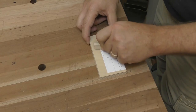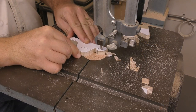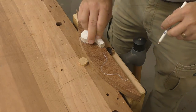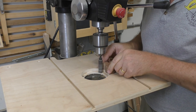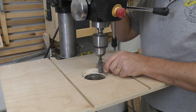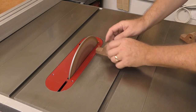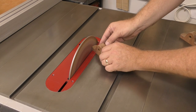The pivot blocks under the arms also need a template, but they're small enough that the drawing can be printed out full scale and pasted onto the plywood. Shapes are traced onto the stock, rough cut out, then sanded to final shape since these parts are a little small for flush trimming. These parts will be mostly hidden, so they don't have to perfectly match — the position of the pivot location is really important. An additional detail is that the ends also need to be rounded over along a different plane than the profile, as shown in the measured drawings.